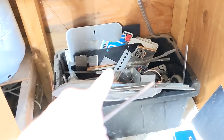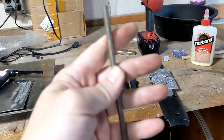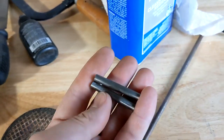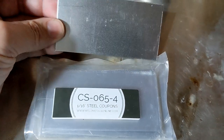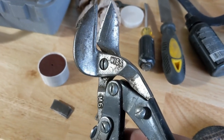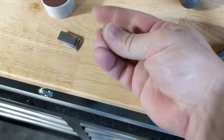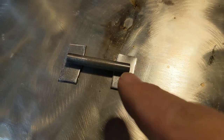Digging through my random bin of metal, I was able to come up with this piece of wire - I'm sure this is from my master's degree, we were bending wire like this with a robot, so I must have grabbed a chunk of it. I cut two lengths off and polished up the ends a little bit. I've also got this bag of ten mild steel plates for practicing welding. I'm going to use one as stock material to finish out this little thing I'm fabricating. Pushing my tin snips to the absolute limit, I was able to cut four of these shapes out of some sixteenth-inch carbon steel, and when they're done being cut they're a little bit crooked, so I just come over to my vise - Bob's your uncle.